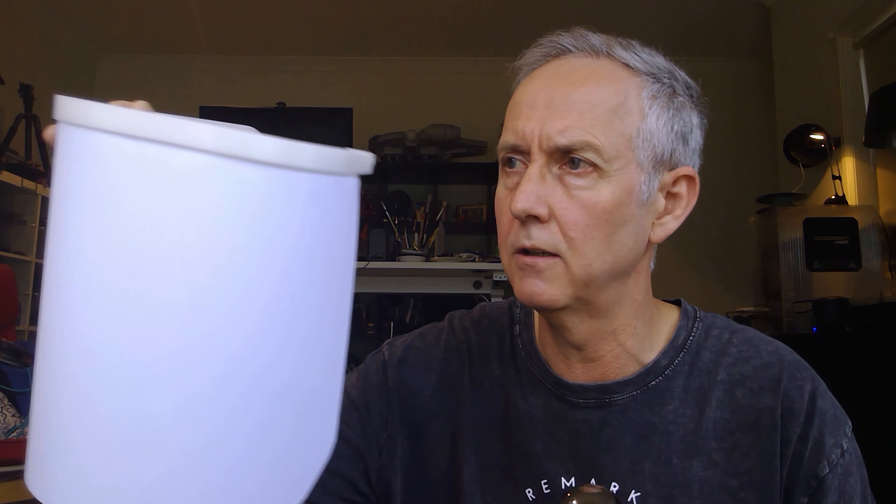What I've been doing is using A4 white printer paper for the prototype — there it is there. You can see it just clips on to the headpiece using this piece here. It's got a little nub on the bottom that just locks into the side, so it slides on and clips onto the front of the shield. The beauty of that system is that you can have the plastic flush with the top of the shield mount, or if you want to protect more of your forehead and have it come up higher, you can adjust it to go up above the top of the shield bracket.